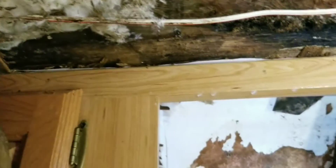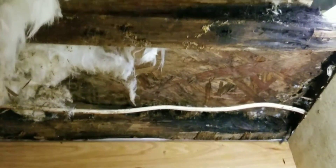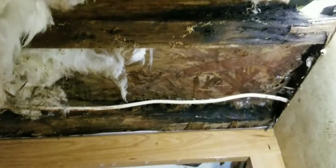Thank goodness I've got some pressure-treated plywood from my mom's. I'm going to try to fix it all from in here and cut these out back here, then sister up some 2x2s to this 2x3. I don't have to cut back because it's solid back here — it's just this section that's soft. I did get the cabinet cut out and got the bottom part ready to frame up.